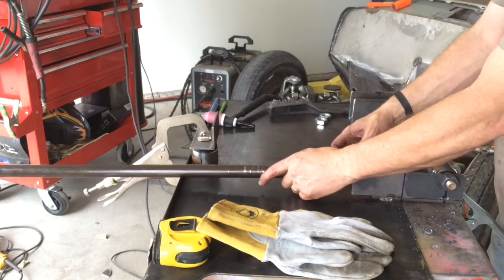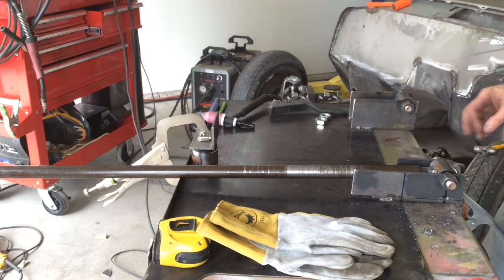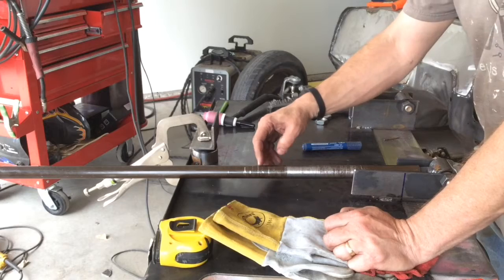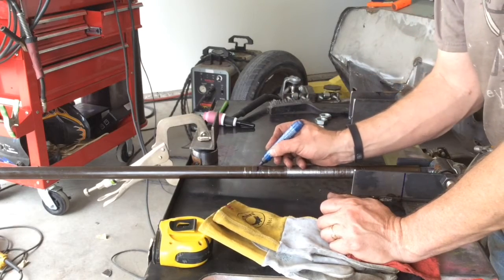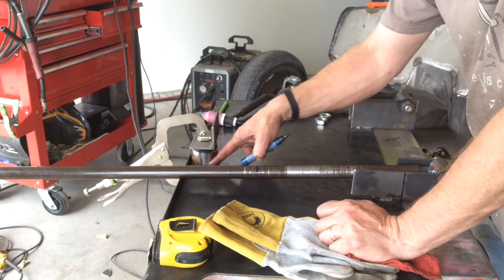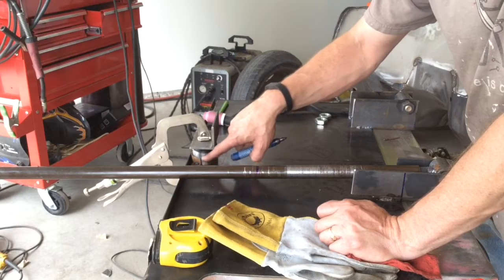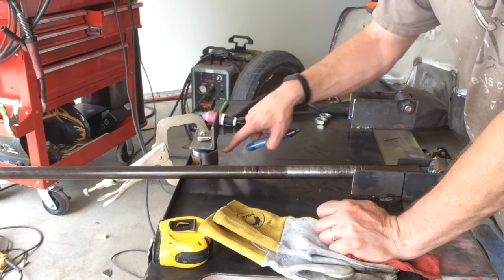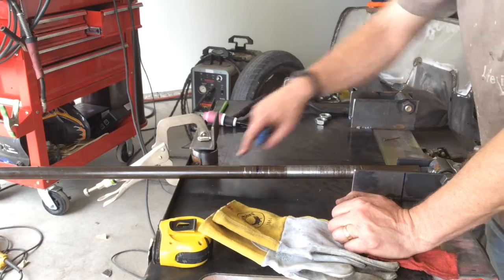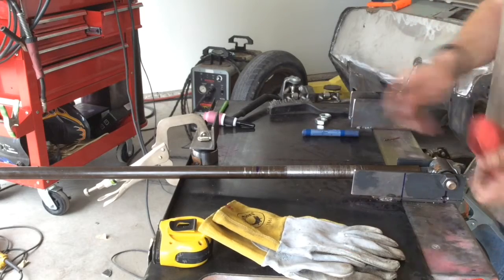So what I want to do is come off and come into the collar there. Okay, so what I think I want to do is put a bend pretty late in it. Probably right in this area right here. That'd be about the center of the bend, and then have it turn in so that when I notch this tube, it's completely on the collar before we get to where my brace is there, that little piece of tubing that's holding it in place. And that's about the center of that collar. So I'd like everything just inside the center there, or inside that line. So that's the direction I'm going to go.